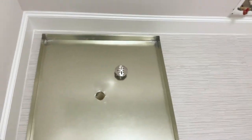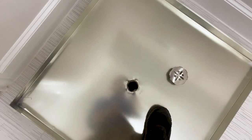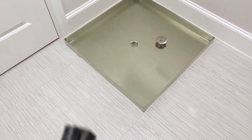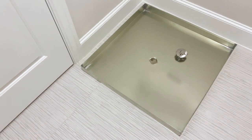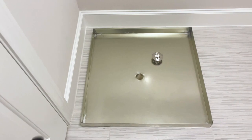Here's a unique find — the drain is clogged in the laundry room. Josh caught this; he just popped off the drain and you can see it's holding water. There shouldn't really be a p-trap in the drain line here because it needs to flow out naturally, and this isn't connected to the sewer — it just connects to outside. So there's probably a clog in your laundry drain line and it just needs to be blown out or snaked.